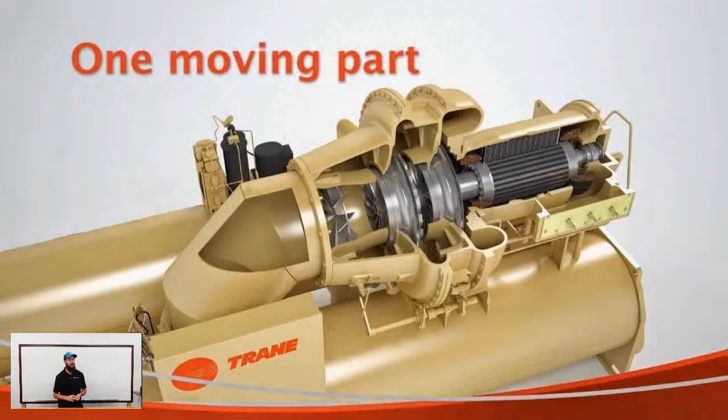Now, this is a Trane CVH F series compressor. What you can see is there's multiple chambers to this. On the far right side of the screen, you have your rotor assembly. That is the motor rotor. It is all one solid shaft assembly. And in the middle of the screen, those silver pieces inside of what would be the compressor housing, those are your impellers. Now, something Trane does is they run a low speed operation. I always forget, it's 1800 or 3600 RPM. But each one of those impellers feeds into another.